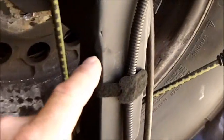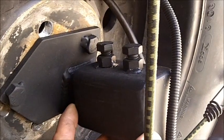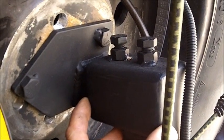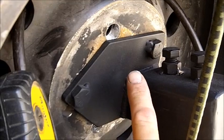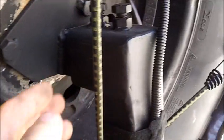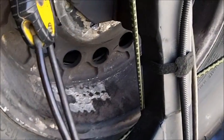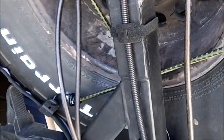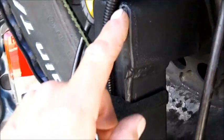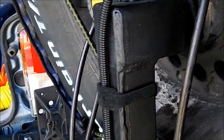And then I also took the idea of Detours, where they had basically a 2x2 inch piece of tubing up here, and used this part from the Detours tire carrier, and I raised it up so I got a good sufficient height on the tire and good departure angles. And then I put a piece of plate right here, welded that all in, reinforced it.